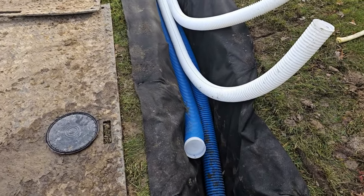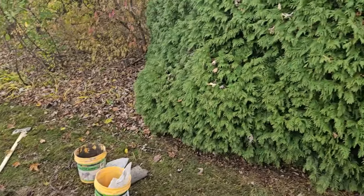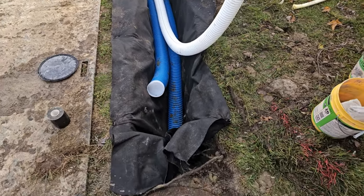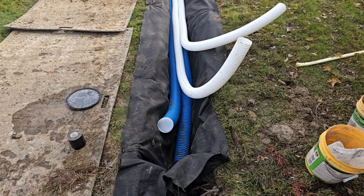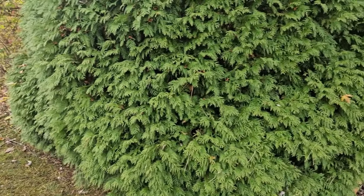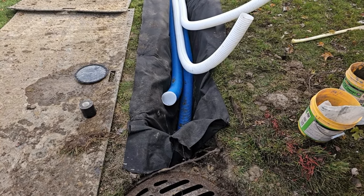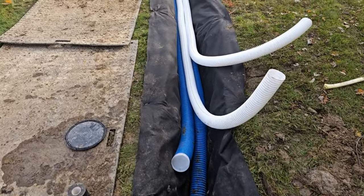So we're going to make sure we have all this air. If we have a cedar tree — which has a very aggressive root system that can sniff out water — we don't want any water left in the trench. People always ask why we don't put stone in the bottom of the trench. I don't want to put stone in the bottom because that pocket of stone is going to hold water, and then this cedar tree is going to sniff it out and get into that layer of stone holding water underneath the pipe. We like to lay our pipe on the fabric on the bottom and then backfill with stone once all the pipe is zip-tied and put together.